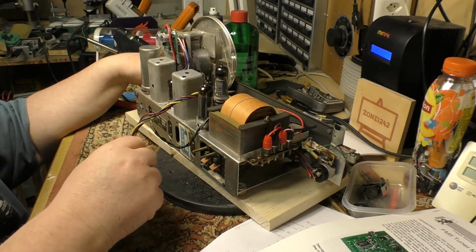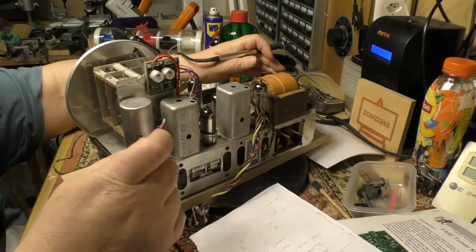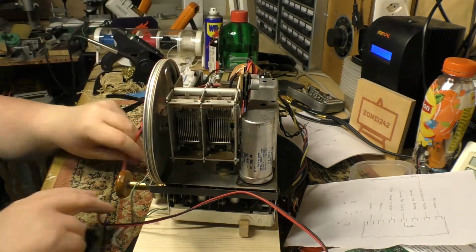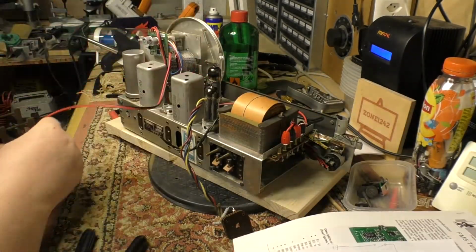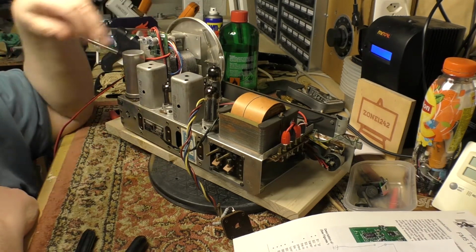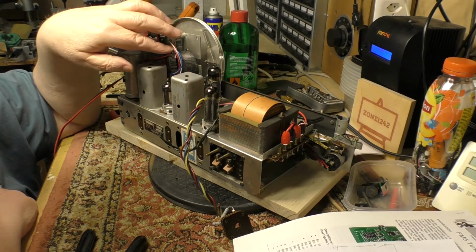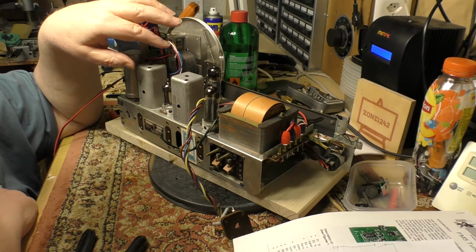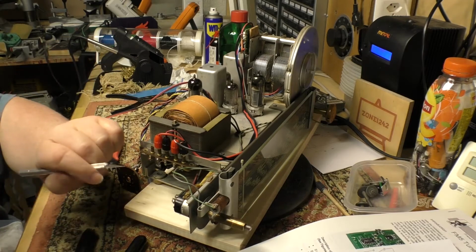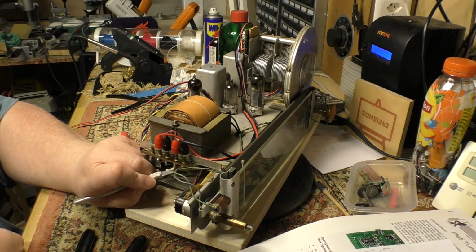I think we're getting close to mock-up. Just need a wire for the antenna, I think. So if this is antenna, 6.3 volts AC, then we have the AM/FM selector. We have the two connectors to the variable condenser. We have the audio out. Just have one last little piece to do over here. This end connector is not connected, so I'm gonna run this one to chassis.